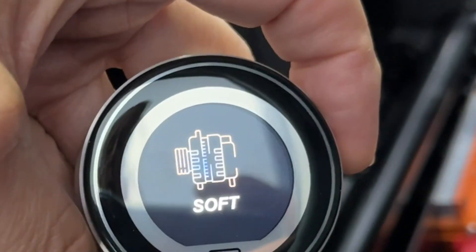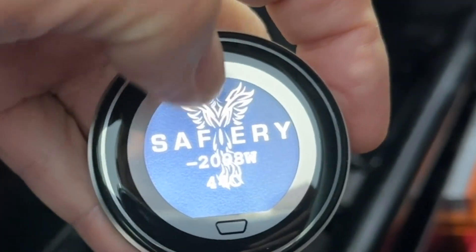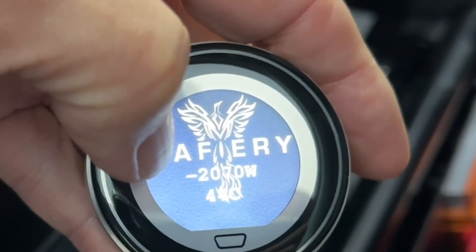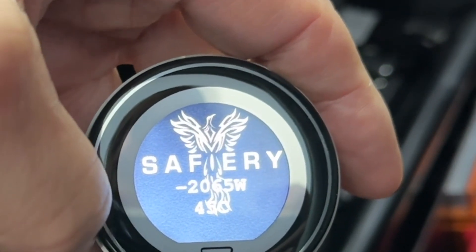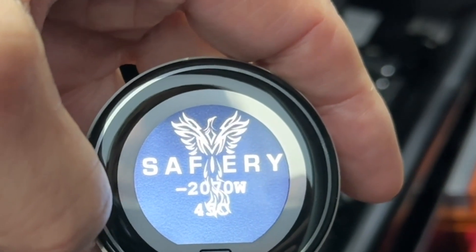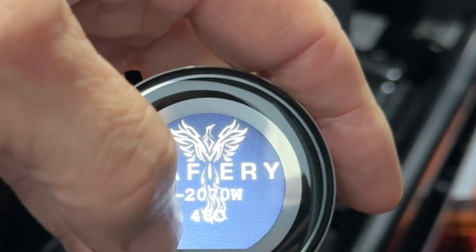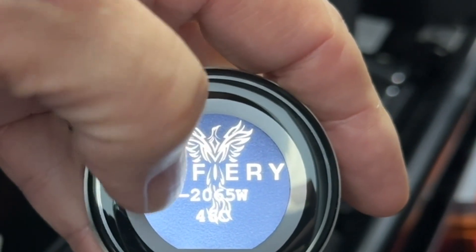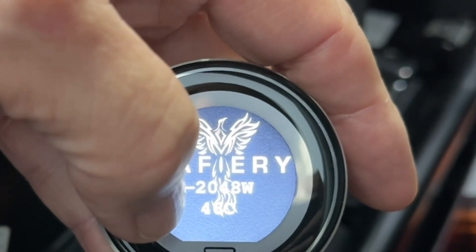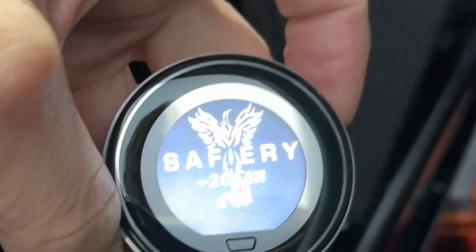Let's just go back to idle. The power here will just slowly start to drop down — that's sitting at about 2000 watts. The temperature has risen from 40–42°C up to 45–46°C. At 90°C it starts to taper off, and at 100°C there's no power at all — that's how we've got it programmed. The big advantage of this is if the weather's poor and you want the backup, you've got it.